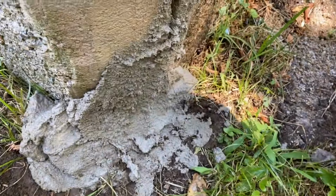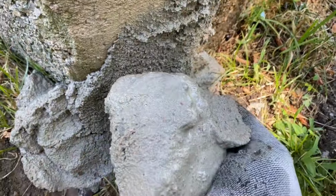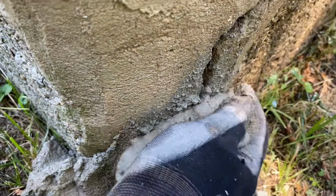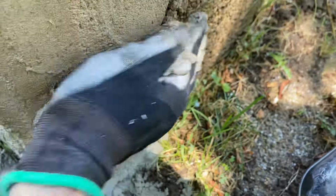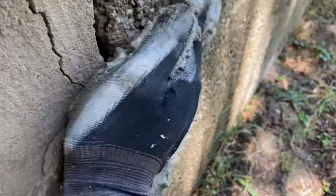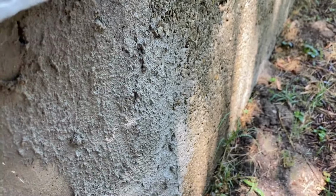Okay. I'm gonna take some thinner mush and we're gonna place it in where that rock fell out right here and inside that crack. And just kind of go like this, back and forth, like that. And we're gonna work it hard into those cracks. Okay. Keep working it in. Don't worry about overspill. You're going to get some overspill. Just work it in that crack.